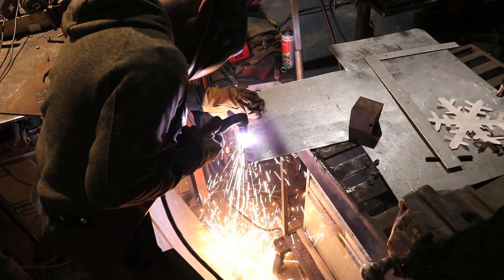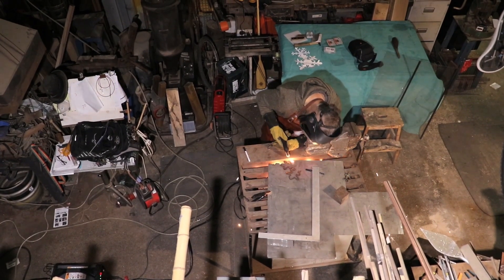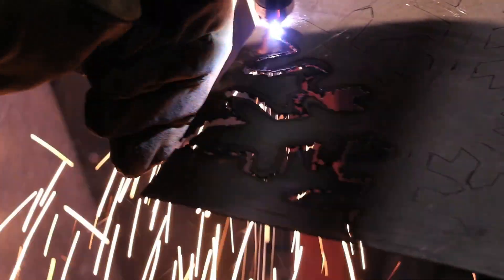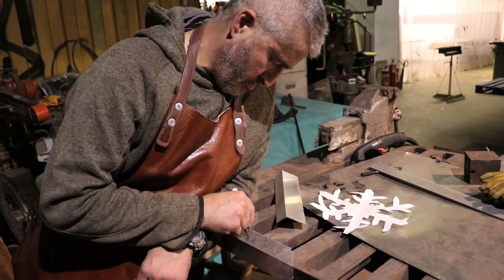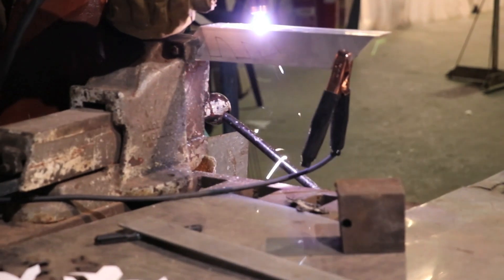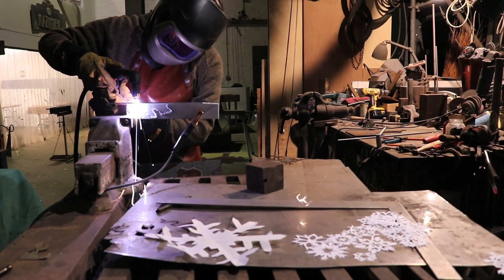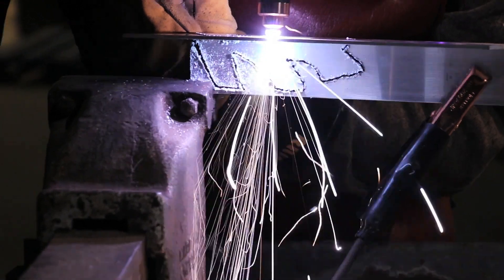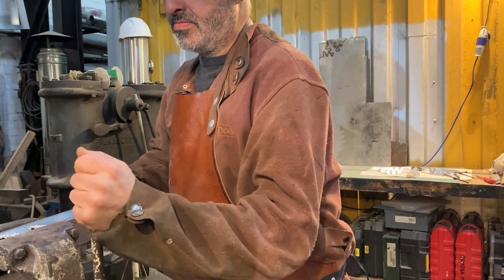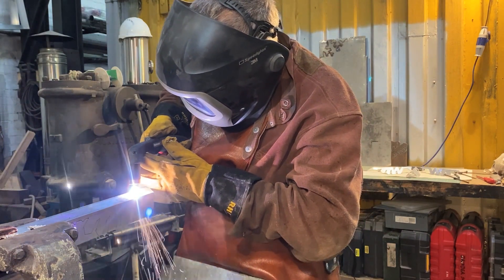There were decisions on which material, thickness, finish, and cut. It was just an evolution of going through stainless and carbon steel and then ending up with aluminium, which is quite a cold material and looks very ice-like. It's very soft, so once it's oxidised and the material has got a certain finish, it tends to stay like that — it doesn't need lacquer to preserve it. It's a very long time before the oxide layer deteriorates enough that it starts rusting or corroding.